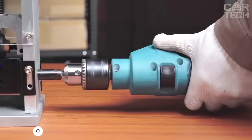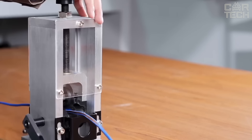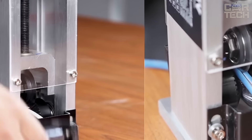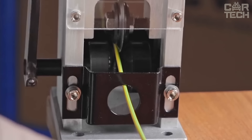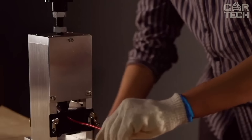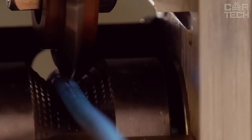The V-Vore manual stripping machine allows fast stripping of wires from 0.06 inches to 0.98 inches. Wire stripping can be done manually or with a connected screwdriver drill. The mini machine is made of cast high-strength aluminum and alloy steel, and weighs only 7.6 pounds. There is an acrylic clear panel on one side that allows you to monitor the stripping process. There are special clamps for adjusting the depth of cut and an adjustable blade made of heavy-duty steel. This machine can be used to clean soft and hard sheathed wires, single and stranded wires. There is a special handle for manual drive which is smooth and easy to operate thanks to the gear system.